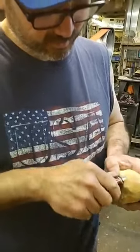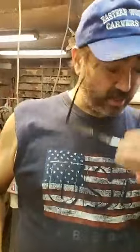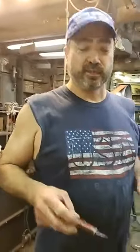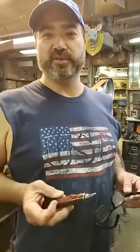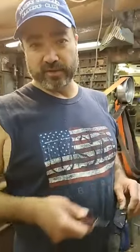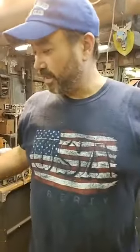Don says he uses a John Burke machine I bought years ago, has a low RPM motor. Yeah, anything works, and what I would advise is quenching. Touch it on the belt sander, touch it on a wheel, dunk it in water. It's better to be safe than sorry. Because if you burn your tip, then you're going to have to go grind that off too, because it just won't cut right after that. So that's about it.